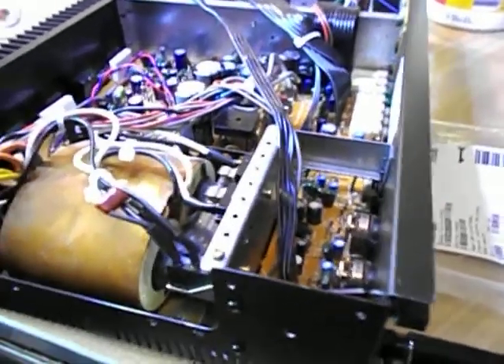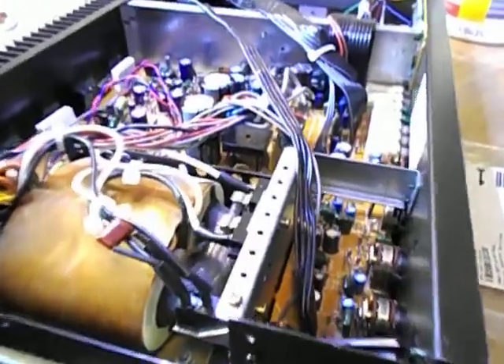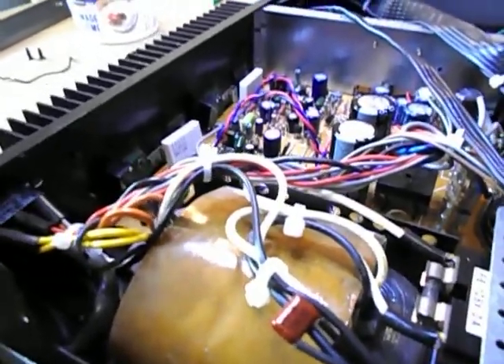I've got it off right now because I was cleaning the controls. This one had a little bit of noise in the power supply, so I replaced all the power supply caps and set up the bias and the DC balance, and got it working really well.